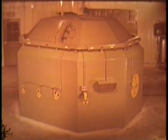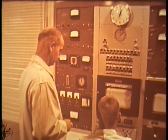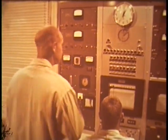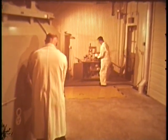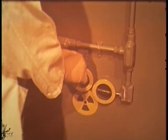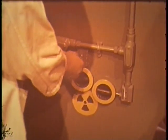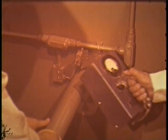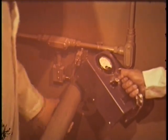The operating philosophy contemplates a reactor that, for normal operation, has available to the operator at the control console a total excess reactivity of only 60 in-hours. Any additional reactivity which might be needed for or accrue from special experiments is under stringent administrative control through key locks on all features which significantly affect reactivity — for example, the glory hole.